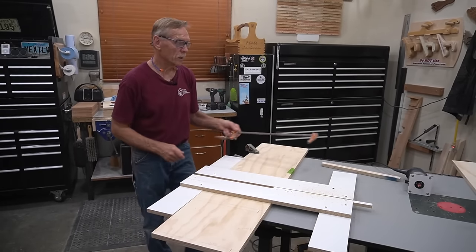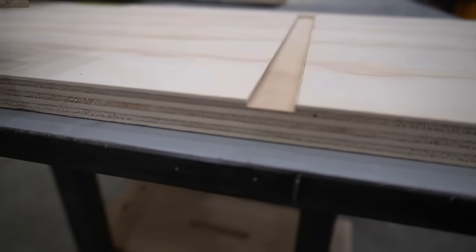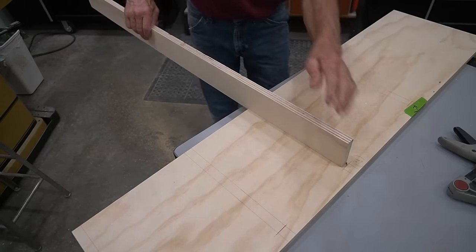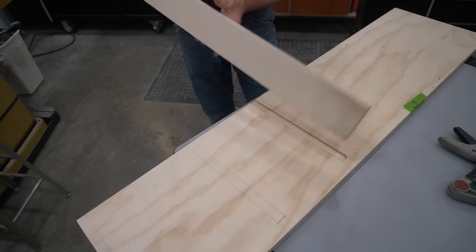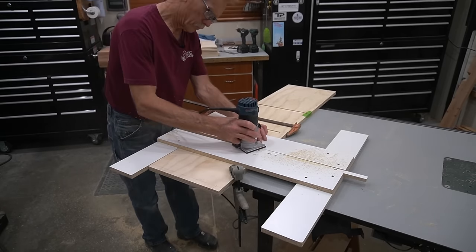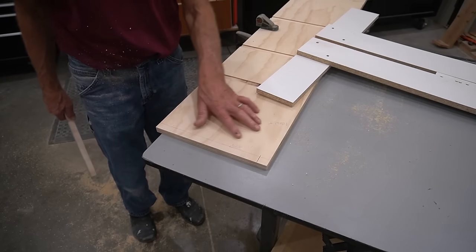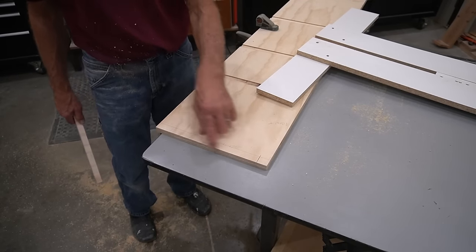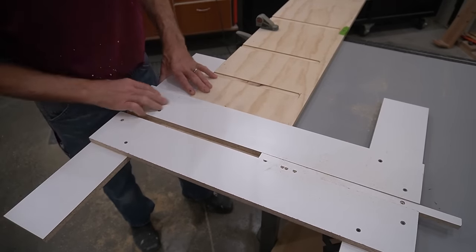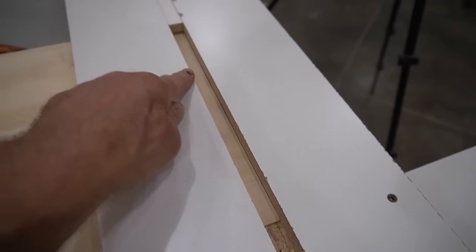I fire up the router and make the stop dado by going down one side of the gap in the fixture and back on the other side. I'm able to start the router on the outside of the fixture and move it in without needing to plunge down through the slot — part of the quick and simple feature of the jig. That is pretty tough to beat for plowing a stopped dado in sheet goods. I quickly pay off the time invested by resetting the fixture to plow two more stopped dados in the side piece, taking an extra measure for dados at the very top and bottom of the panel.